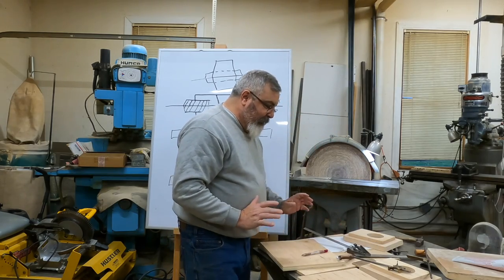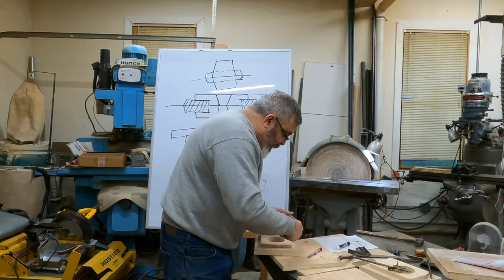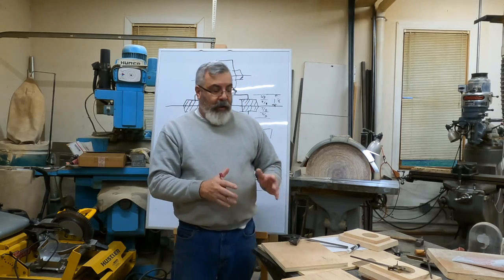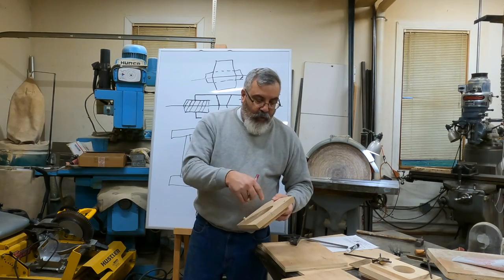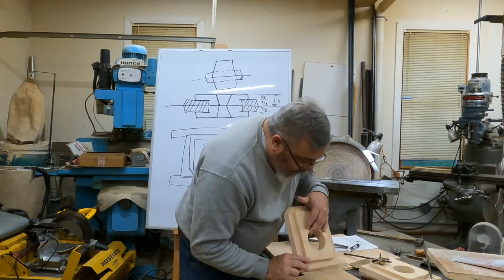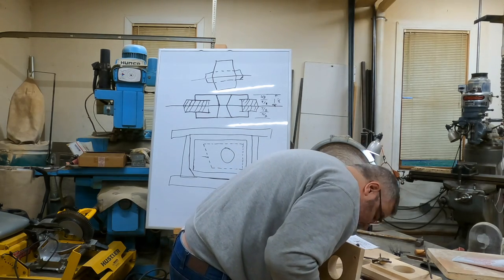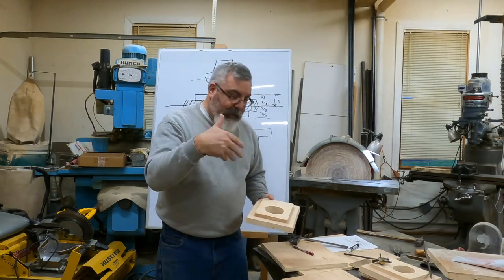Like I said, I want to try to get this. If I have some excess, we'll see. All right. Sometimes what you could do, if I hadn't put that pattern top on, I could take this pattern, put that core on there, make sure it's the core print, make sure it's the same, but I have this, it's going to be in the way. I mean, we could check it like this. That would work, make sure we're where we got to be. So it's just a tad under there, and looks like a tad under there too, so we checked it, we're good.